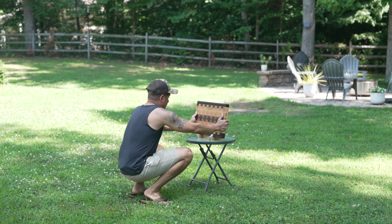Flush trimming is very intimidating, especially on thicker stocks. Start on the edge or the long grain and never on the end grain. Use a starter pin and go slow until you make contact with the template. After that, it's pretty much smooth sailing.